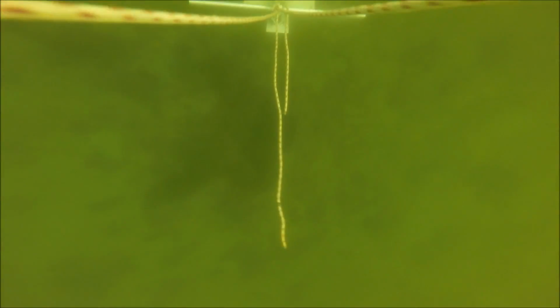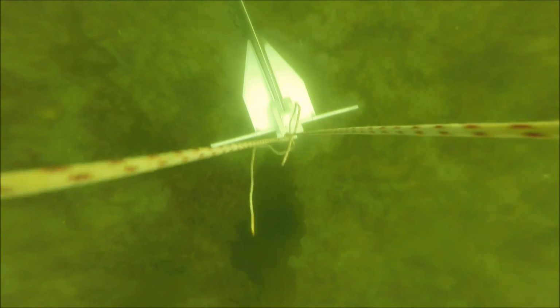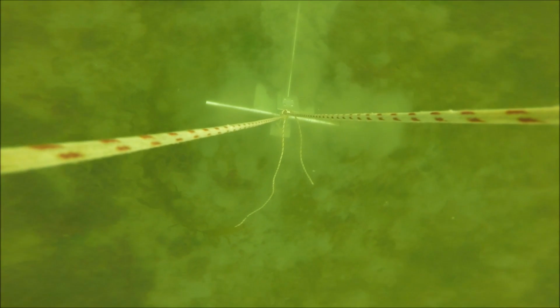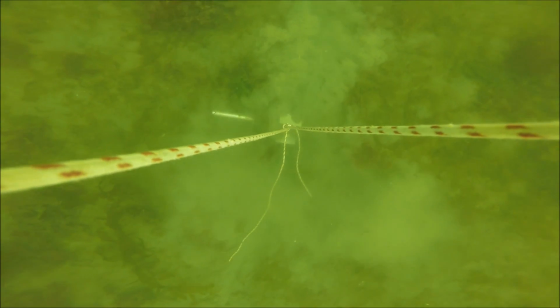So I decided to do this same back and forth reset test on my other aluminum anchor. This is the 10-pound Fortress FX16. Here it is on the initial set. I'm just backing down the boat at 2 knots in my normal fashion, and then I set the anchor fully at 3,000 RPM in reverse.